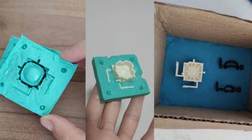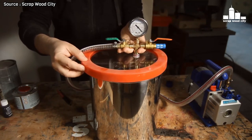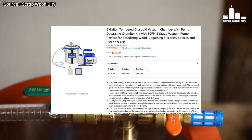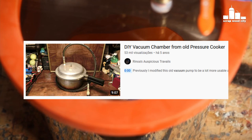She tried making her own mold for it. But the pieces didn't come out well. It's because the bolt and gears have too much detail, and the resin couldn't fill it completely. Turns out that we will need a vacuum machine to suck out all the air from the mold to have a perfect piece. So I went online to look at a vacuum machine, and yeah, it was too expensive. The project will need to stop as it will be impossible to get a vacuum machine for cheap, and I wouldn't try doing some risky ideas with a pressure cooker.